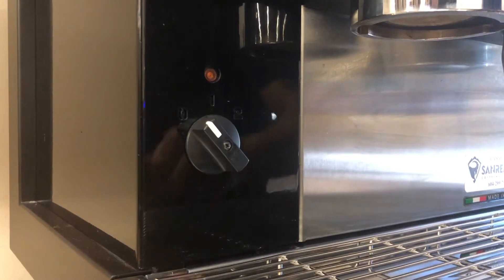At this point we can turn the machine on — this is very important: the machine needs to be turned to number one on the main power switch, and that's the startup process. You should hear the pump activating and see the gauge pressure going towards nine bars. The machine will take a few minutes to fill. If it goes over two minutes without filling, the machine will shut itself down to protect the element. In that case, turn the dial to zero, wait five seconds, then turn it back to one and let it fill.